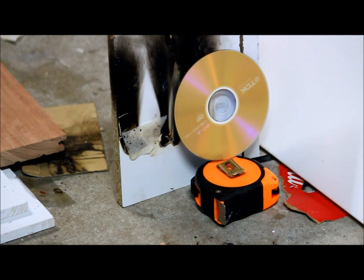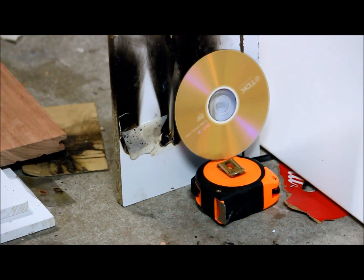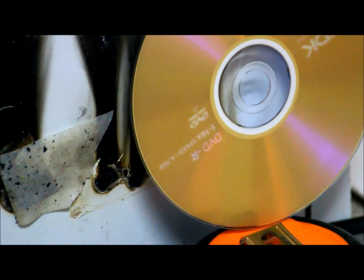The next material is a DVD. What this is, is actually a piece of plastic with a piece of metal in between another piece of plastic — basically a sandwiched piece of aluminium foil-like material between two plastic sheets. Since the plastic is opaque, we should be getting a burn on the plastic and not too much distortion in the metal for our quick burst. For our long burst, we should be getting penetration into the plastic and then into the metal. I'm just going to zoom in and we'll do our short burst.